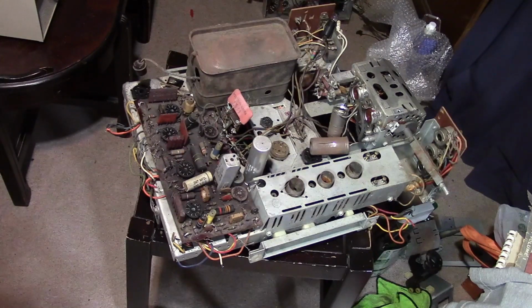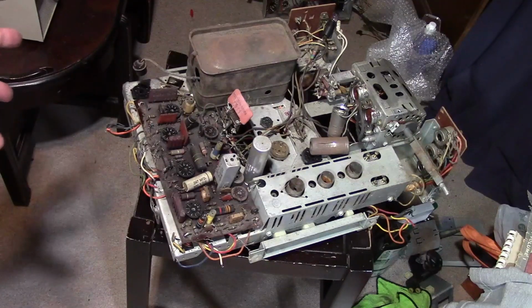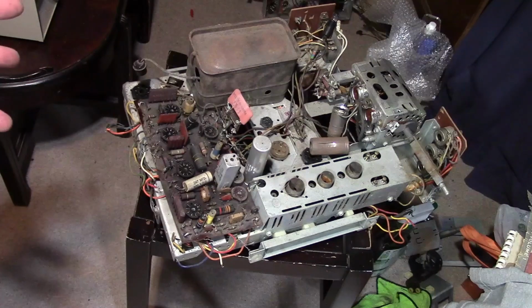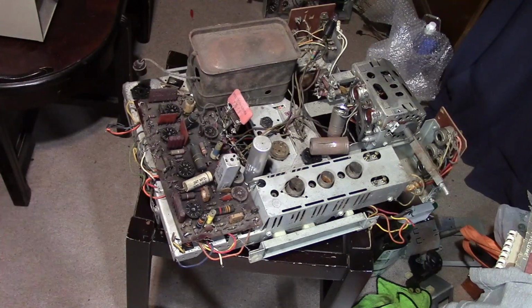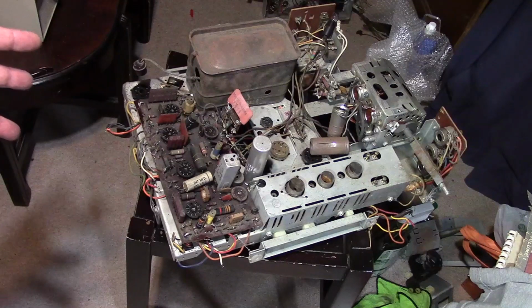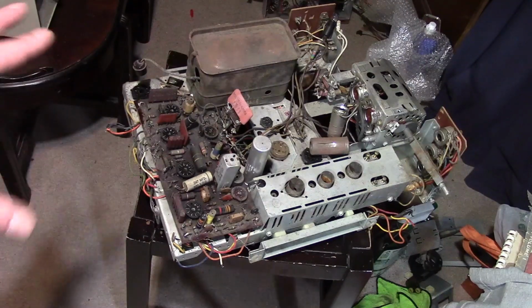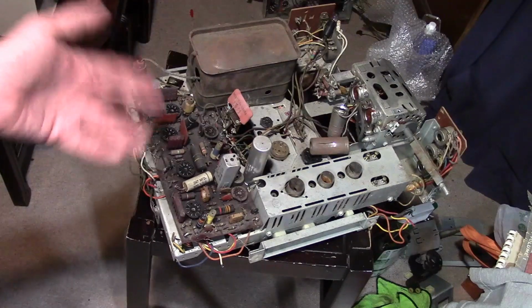And the tubes they use are common tubes used in many sets. So the tubes themselves are not running any hotter filament-wise. So what other way could a tube run hot? If you bias it so that it's drawing a lot of current, like near the design limit, like nearly red plating on a power tube, they weren't. There's nothing extreme about any of the way they were using the tubes. And then a little gets burned up in resistors.